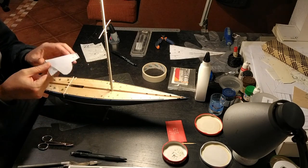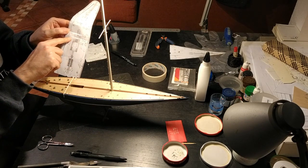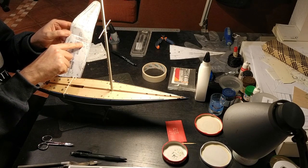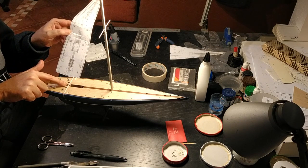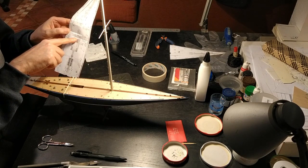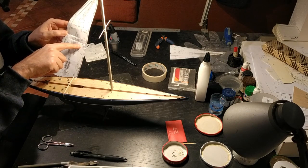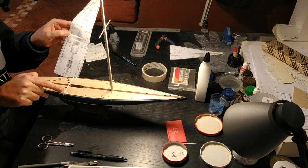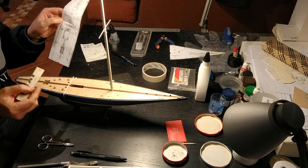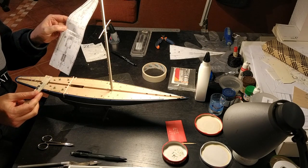To see where the cleats should be placed, I measured the distance on the plan — in this case 5.1 centimeters — and taking off the difference of 6 millimeters for the blue wood, I divide that by two. From this edge to where the outer edge of the cleat should be is 2.2 centimeters on each side. I measured it with a ruler and put the marks so I know exactly where they should go and in what direction.